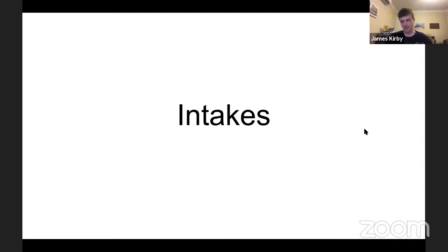It's used by a lot of good teams because of its ability to be under high tension and therefore not have any slack. So for precision moving of elevators at high speeds, wire is good. We've only ever used rope on our various elevators because it's just a lot easier to use. It's strong enough. You can get ropes that can hold 400 kilos. That's definitely enough for all FRC purposes. So unless you know you need wire, just use rope.